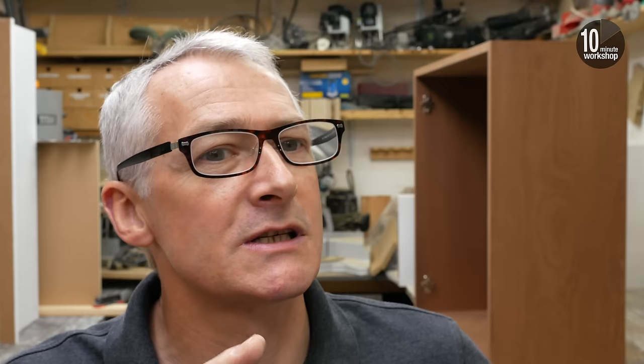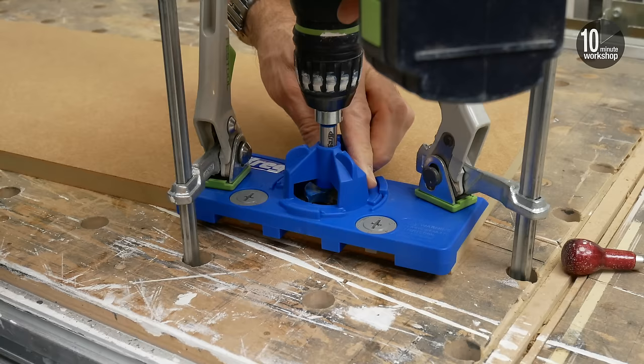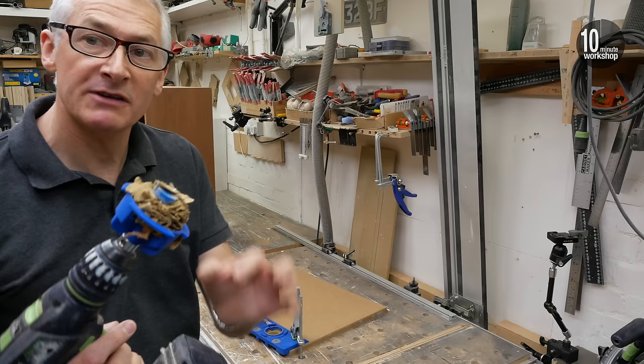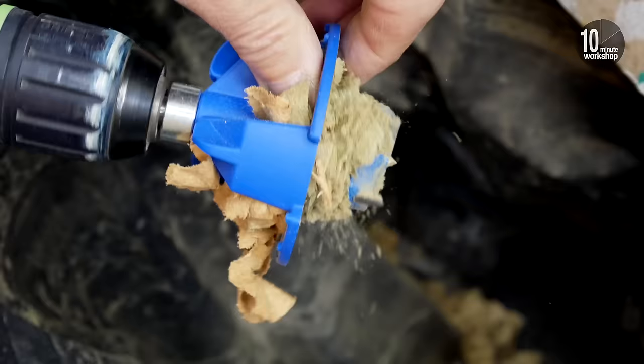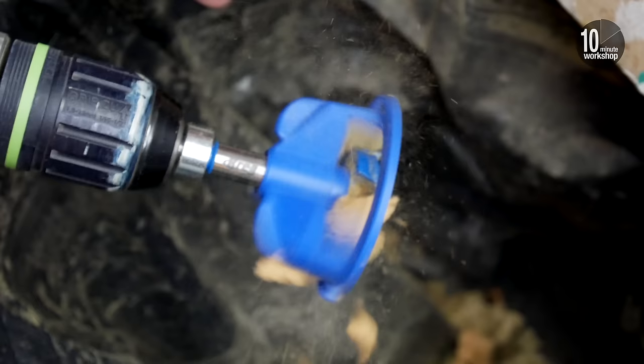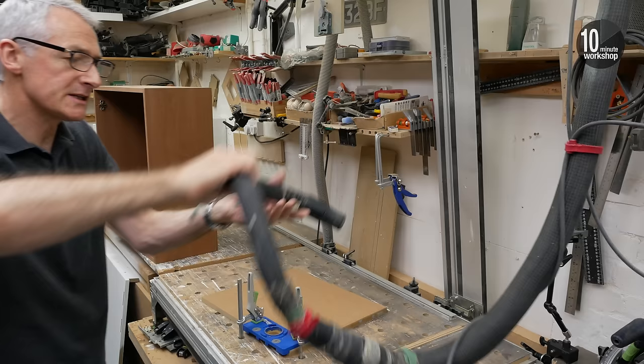I mentioned earlier there were a couple of slight caveats. One of them is the distance from the edge — I personally prefer to have mine inboard a little further. The other I'm going to have to show you because it's a bit strange and I don't know if it's just this jig or all of them. So we've got our little jig clamped against our mock door, all lined up against the pencil mark. We've drilled out the central cup. What happens especially with MDF is that everything gets contained within the shroud, so it's quite easy to clear out — though you will need to clear it after every hole with MDF. You can fairly easily vacuum that out.